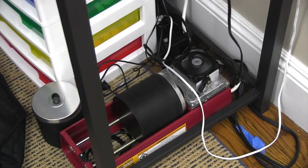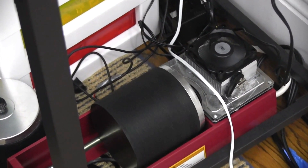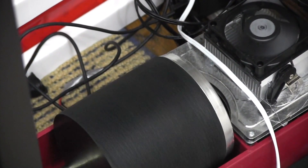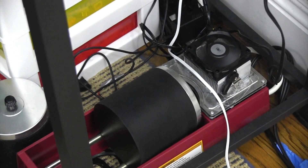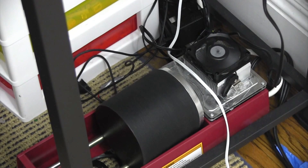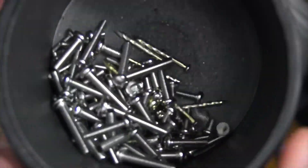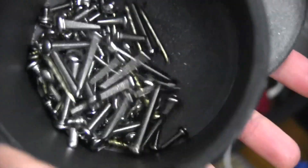Now I'm going to show you how I polished these. Here you can see my rock tumbler. At the moment I only have one barrel spinning because I'm only polishing the stainless steel filament, but I can have two different filaments being polished at the same time — one barrel with bronze screws and one with stainless steel ones, and I can use them for whatever metal filaments I'd like. I use cheap little metal screws. The way it works is the screws are inside the barrel, and when the barrel spins the screws brush up against each other, and the metal particles get rubbed onto the different prints. It's a really good way to polish these filaments, and as you can see there's a ton of metal particles left over.